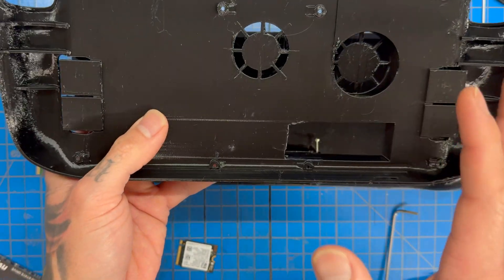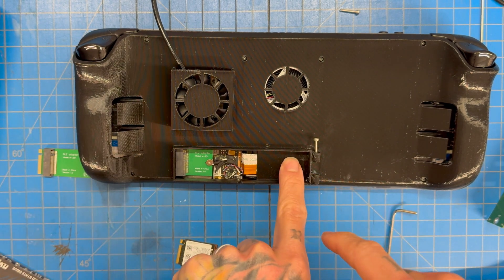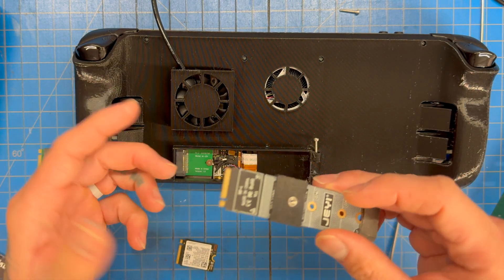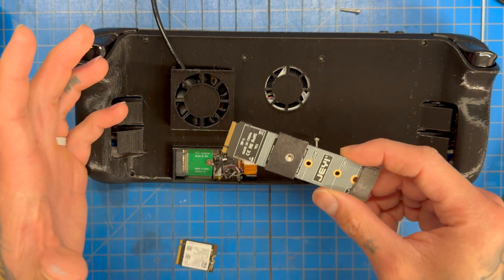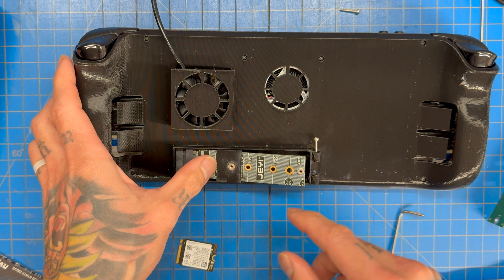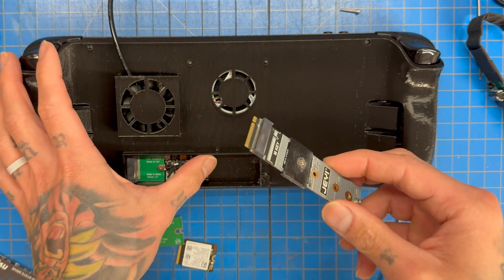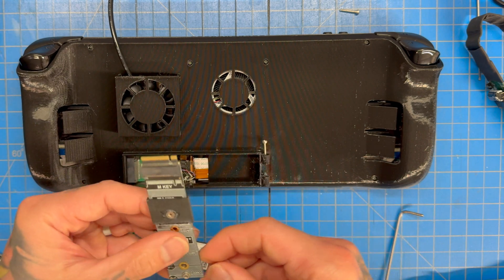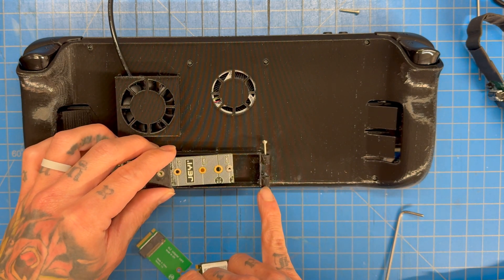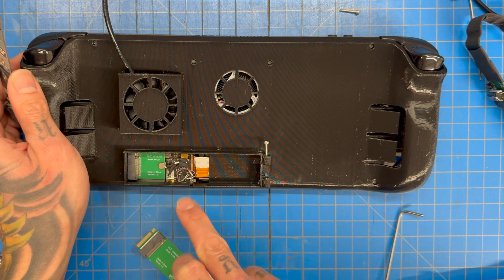This bump out is near flat with this surface, but on this version it's actually recessed a little bit further back — it bumps out towards me about a millimeter and a half. The reason for that is this backplate needs to sit near flush to the battery. It's probably not the best practice to have it pressed against the battery, but it's the only way to get this full-size M.2 extender in there without it bending too much. This thing is slightly angled, so as you press it down it bottoms out. It's simpler to have two pieces and it actually works pretty well. Your bump out is smaller this way — stacking another one would make it bulkier and run into the screw hole issue.